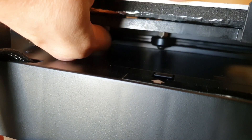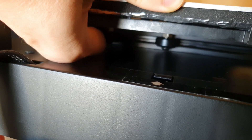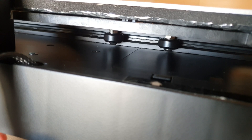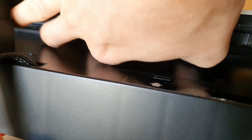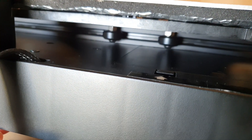What I aim for is I just get my finger in there, hold the bed still, and try to rotate that wheel without the bed moving. As long as my finger is able to reasonably rotate each wheel, it means the wheels aren't locked on too tight — they're down inside the V-slot and sitting firmly, but not so tight that they can't be spun independently. I feel like that's just right. You can check all four of them. The other side should be reasonably the same tension, and both should be about the same tension when you're spinning both of them.